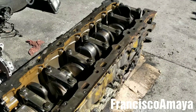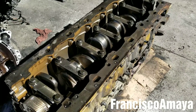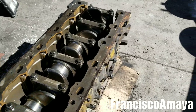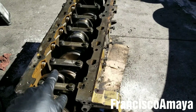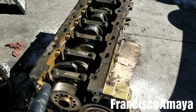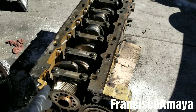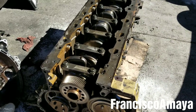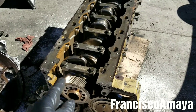Today I'm going to show you how to replace the crankshaft on a DD15 engine. For DD13, the process of tightening the bolts is going to vary, but for DD15 and DD16 it's going to be pretty similar. The size of the crankshaft is going to vary between all those. I'm going to show you the part number of this specific DD15 engine, but this doesn't mean this is going to be the right crankshaft number for your engine. To get this part you have to use the engine serial number of your truck — be sure to do that, because the crankshaft varies in size for torque and this can affect in a massive way the amount of power the truck can produce.